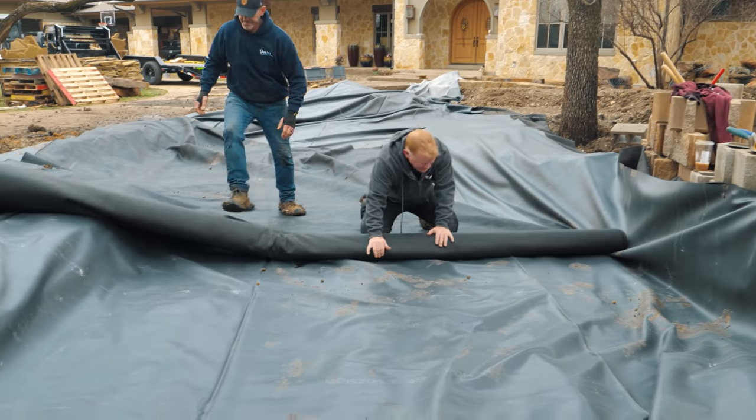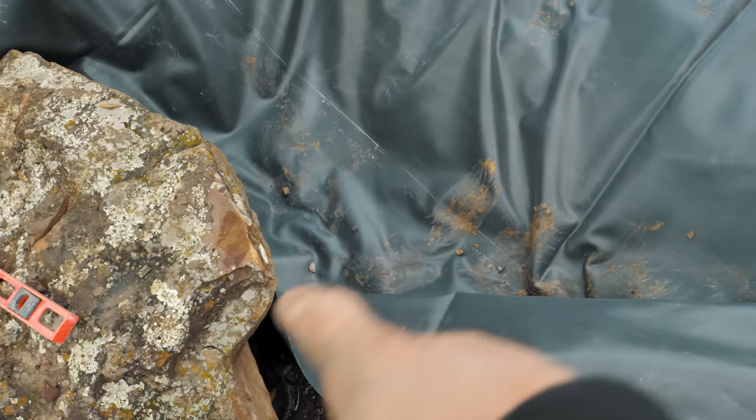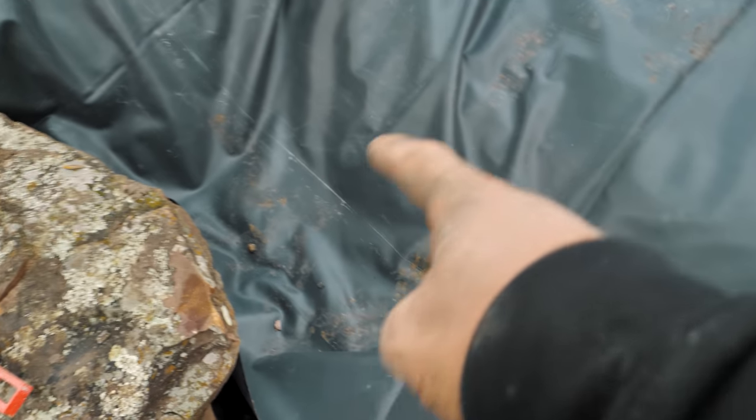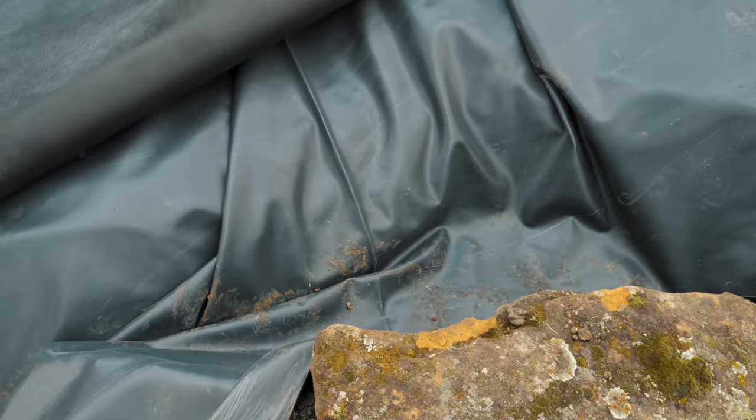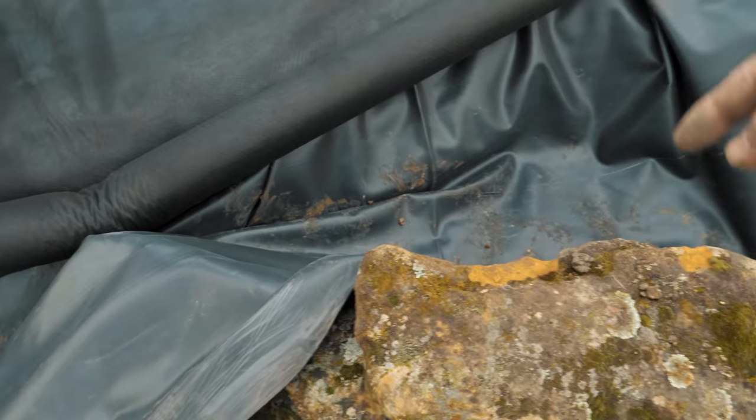Alan and Brian are pulling in some fabric now. We're going to lay that all the way into this excavation. We've got probably about a two-and-a-half foot gap behind these rocks. Once that fabric goes in, we're going to load this up with gravel to level it all up. Then we're going to do what's called the bib liner — foam the whole area, put a piece of fabric over to watertight it. This way the water, instead of going back behind the rocks, will actually come up and over and go down the waterfall.